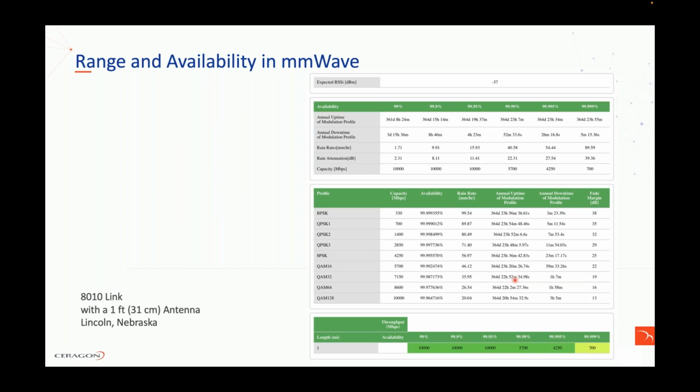And when you're talking especially E-band links, which are capable of doing multi-mile, and keep in mind with the 60 gigahertz stuff, you're just not going to be able to go ultra long distances. Part of it is because of the natural decay effect of 60 gigahertz, which is a good thing. It's the reason why we can use it in high density environments with very little interference, unlike 5.8 or other channels, where the signals persist and cause higher levels of interference.